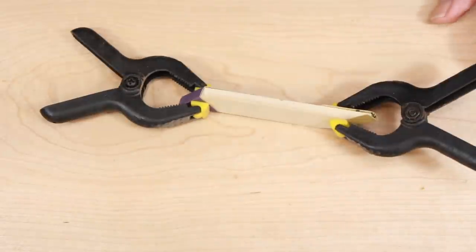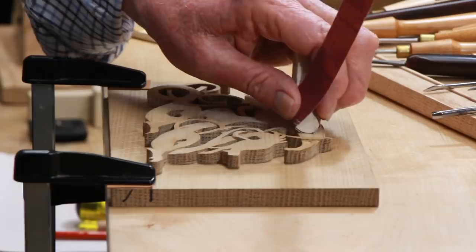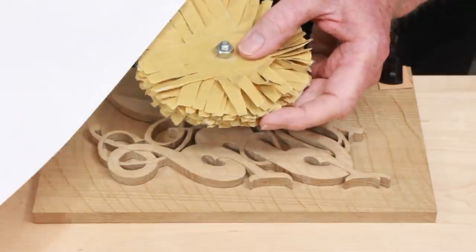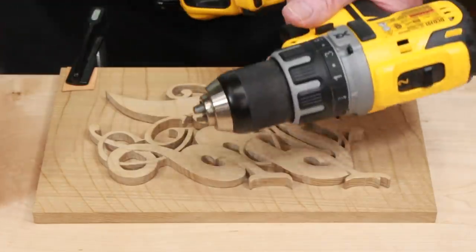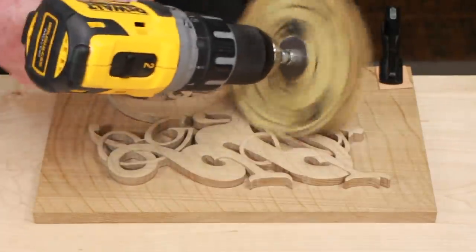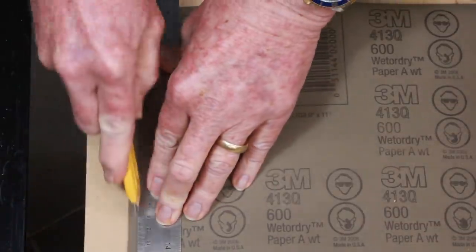Different widths, different contours — big enough to get a good grip on, but with very small sanding areas. There is one trick that allowed me to take advantage of power tools. I made several devices that I will call flap sanders, for lack of a better name. You can see one that I built for use with a power drill. It's nothing more than a bunch of layers of 400-grit sandpaper strips held onto a bolt with a nut and a washer. Incidentally, this only works with extremely fine sandpaper. Used broadly over the whole carving, it removes minor surface blemishes, smooths the surfaces, and softens the edges just a little. I like the effect this gives for this particular project.